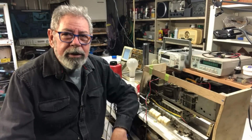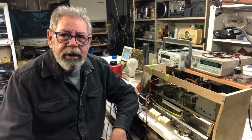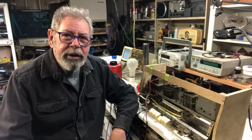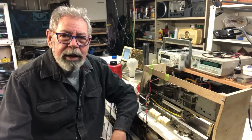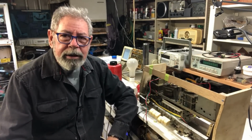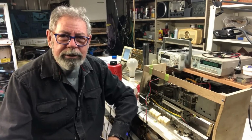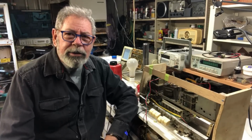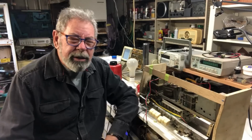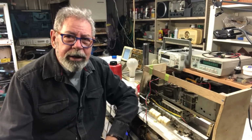Well, it looks like this radio is not going to give up without a fight, but neither am I, so we'll see. I have to admit I've been a bit haphazard in my approach to this, and I'm going to have to be a bit more disciplined and track this fault down logically. I've already spent some time going over the schematic, and in the branch of the circuit where the issue seems to be happening, there isn't an awful lot apart from that switch, one resistor and the IF can. So let's just have a look at the IF can, shall we? I don't know why I didn't do that before. It measured okay with the meter, but there's something going on there. If not, we'll divide the circuit up into sections and track it down that way.